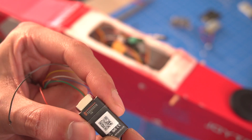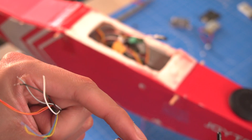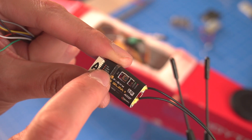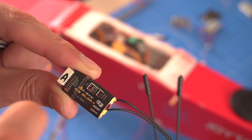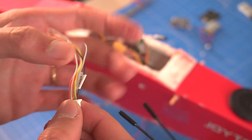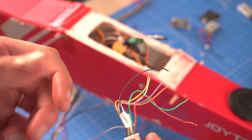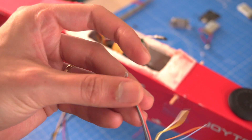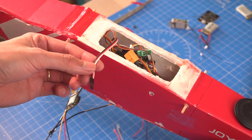At the back we have the PWM outputs, so this receiver can output normal PWM via cables that you connect to the signal pins of the servos. But we're not going to need that. This receiver is made small because of size and weight — it's perfect for racing drones. We have the S-port, S-bus in, and S-bus out — we're going to need the S-bus out — plus VCC and ground. I know my S-bus out is the gray wire, then we have the positive and negative power wires. We'll solder this to a connector to plug it into the flight controller.